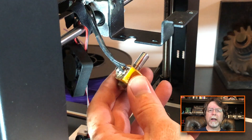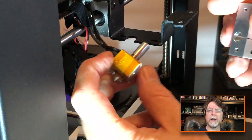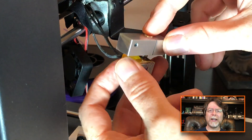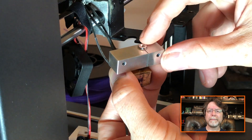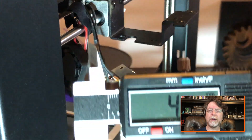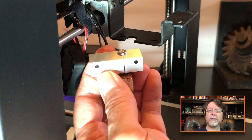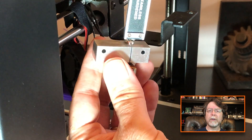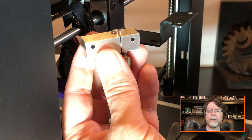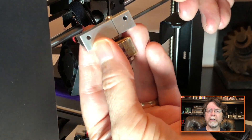Now we can attach the cooling block to the tube. When you attach the block, put it on so that the slot on the block is on the same side of the heater that the wires aren't, and the long side goes toward the front of the printer. Also get a set of calipers and set them to about 1.7 millimeters, because that's the distance that the tube has to stick up out of the block. Once you have that distance measured, you can tighten the block down using the set screw and the wrench that came with the cooling block.